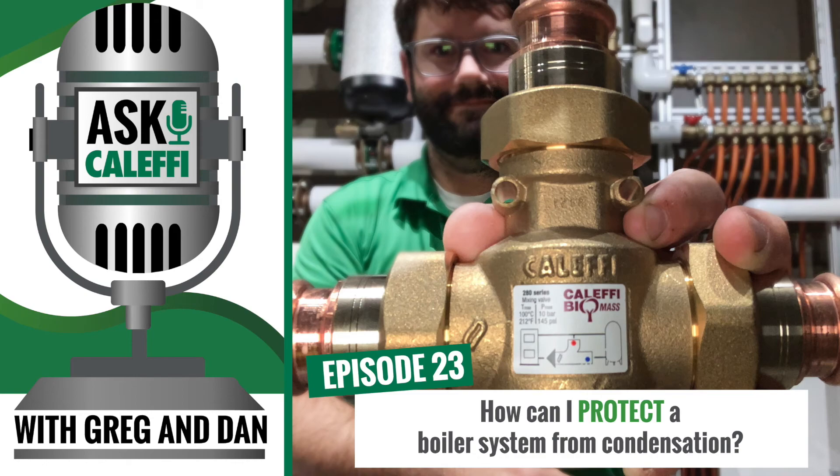When you start seeing five, six, eight year old boiler heat exchangers failing on mid-efficient boilers, pretty good odds you're condensing that block. Those things will last forever when installed and maintained — it's crazy how long a cast iron mid-efficient boiler will last. Condensing can lead to not just sooting up and combustion problems and high CO levels, but I've even seen it cause the block to pop or crack and leak. By all means, this is a huge deal to install one of these.